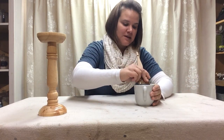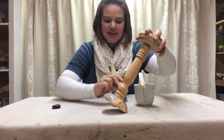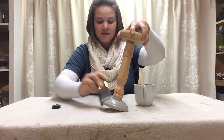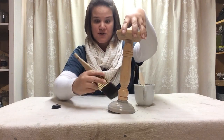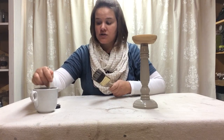Just use whatever you have at home. I'm going to dip my paintbrush in and get started. As we're painting, the shellac that we put on to prep our candlestick in the first place is going to keep those knots from showing through our milk paint. As you're painting, every now and then give your milk paint a stir so that your color remains consistent throughout your entire project.